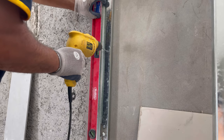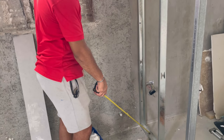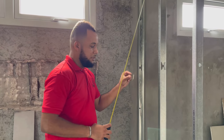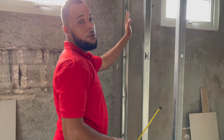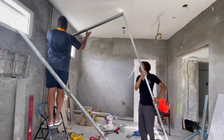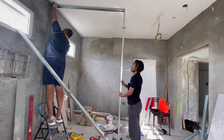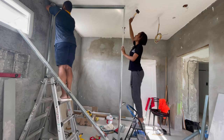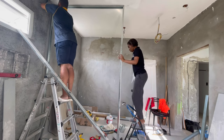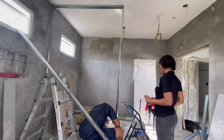Once the track is done, we then need to put the stud. I always recommend starting with the stud that is linked on the end wall. You measure from the base of the track to the height of the ceiling and then you cut your stud. A tip for cutting: you don't have to be exact in the measurement from the base of the track to the ceiling — because it's metal, you can have a little wiggle room, which makes it easier to move them when aligning. Once we have the first stud up, we want to work out the spacing of the other studs. Start with the far end too: put up that end stud and connect the upper track at the same time. Lean it in and affix the stud to the track, and once it is level, everything should be level.